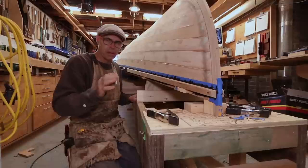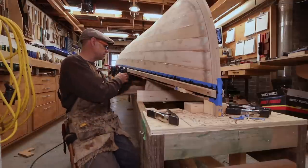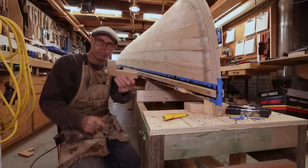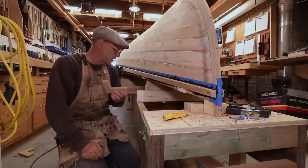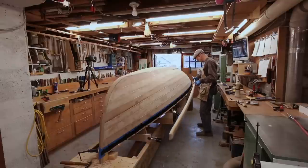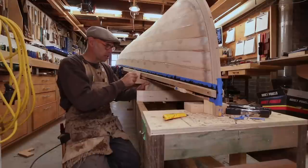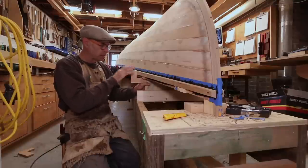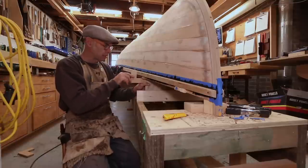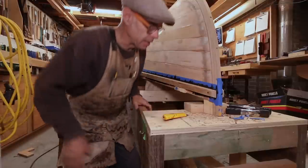It's one of those things you can't know which is the better way unless you do one side one way and the other side a totally different way and time them. For the most part the tape worked out well. Using my batten jacks at the other end of the run — I clamped them to a frame so I had something to drop one end of this into while I bent it around and got it positioned. That was a huge help. Without those it would have been a nightmare.